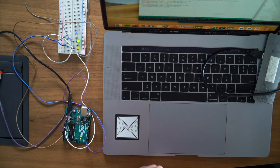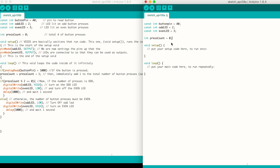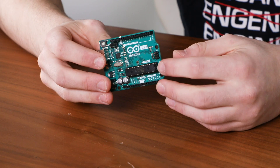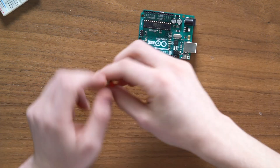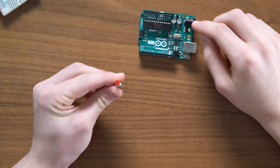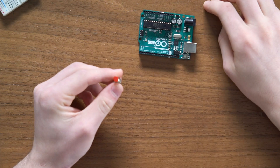Programming this Arduino is done with a computer in the Arduino programming language and Arduino IDE. You write the code on your computer and then you upload it to the Arduino, which runs the code as soon as you upload it or as soon as you power it on. We could talk about theory behind Arduino for days — months honestly — but my favorite way to get practical knowledge is by doing. So we're going to start off with a simple project here. I'm going to use this little push button to cycle between turning on two lights.